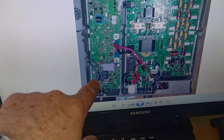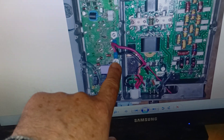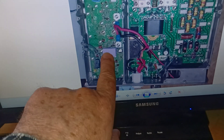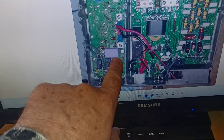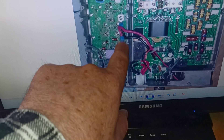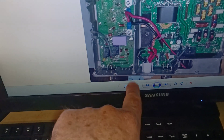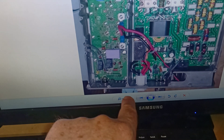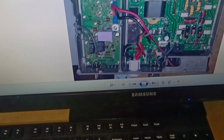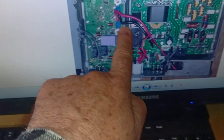This is the HF power amplifier and antenna tuner, and this is the VHF side. Take the covers off both and you'll see two wires that run through here — that's positive and negative at full current. The relay in here is, I think, a 20-amp relay with the contacts wide, and it switches power to the power amp. This is a great spot to take off anything you want to power externally from 13.8 volts, and that's what I'm powering cat knobs and cat display with.